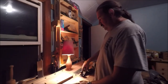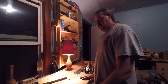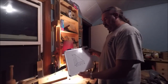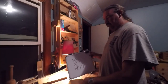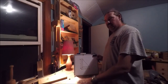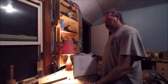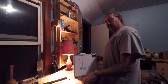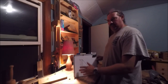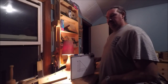Here's the material we're going to use. This one is pretty beat up and scarred, but maybe we can work with it — it's just scrap laying around the shop. Woodworkers in general hate knots, especially in a pattern, because the wood swells on the long grain, but at a knot the long grain runs a different direction. You're going to get weird shape distortion as humidity changes, so don't put knots in your parts — it makes life a lot easier.